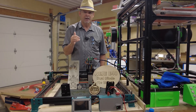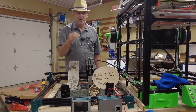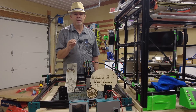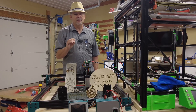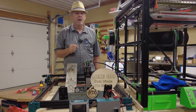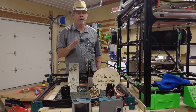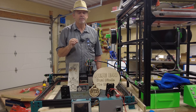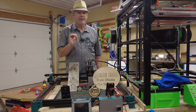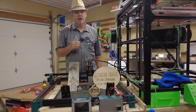Hopefully in the future I can contact support and they can give me the details I need to utilize that. The other thing I didn't like about the documentation is the focus height adjustment. One place it says 3 millimeters from the radiator and another place it says 5. From what I found, 5 seemed to work pretty well for engraving and 3 was a little better for cutting, but I haven't really found that sweet spot quite yet.